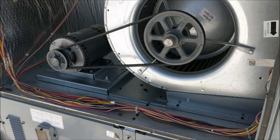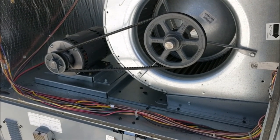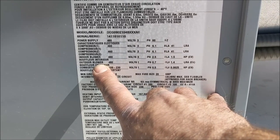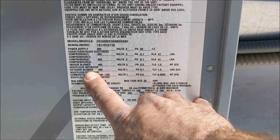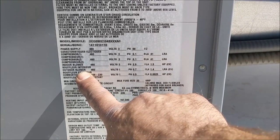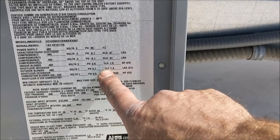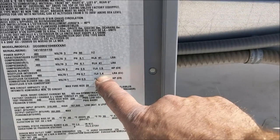If you're not able to put the cover all the way on, put it partially on to check the amps so you can get a proper reading. Before checking the amps on the blower motor, locate your tag which will be somewhere on the unit, or you might even find the tag on your motor, that will show your running amps. On this particular unit, the full load amps will be 1.4, as seen for the blower motor.